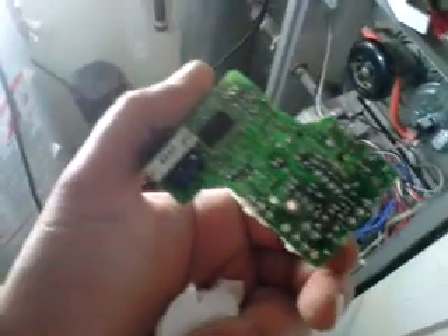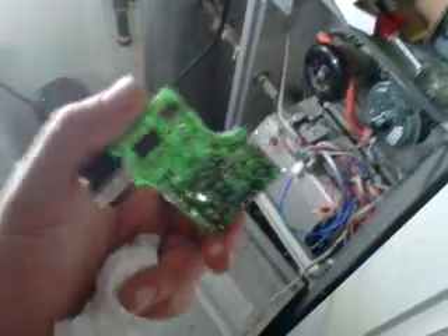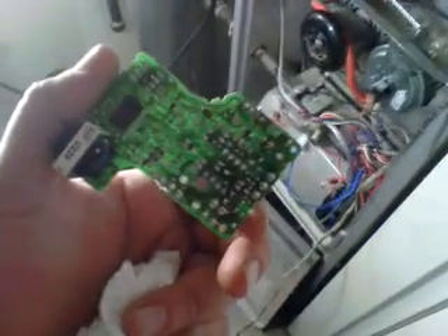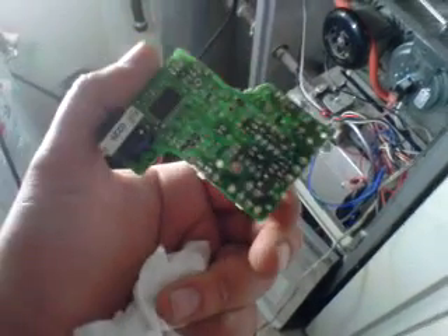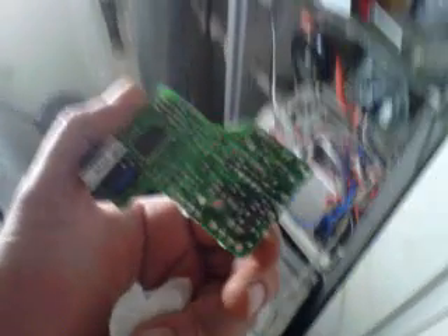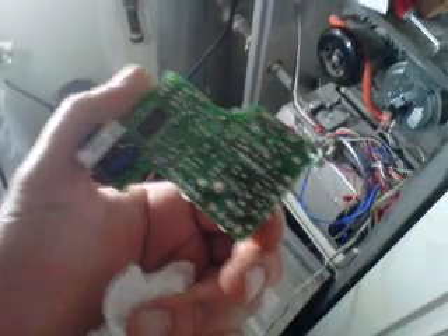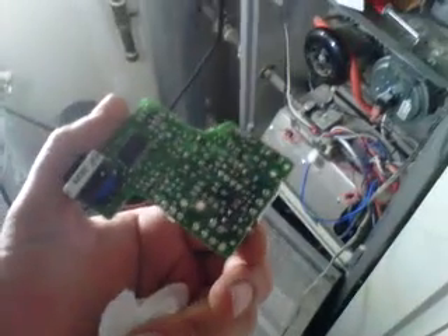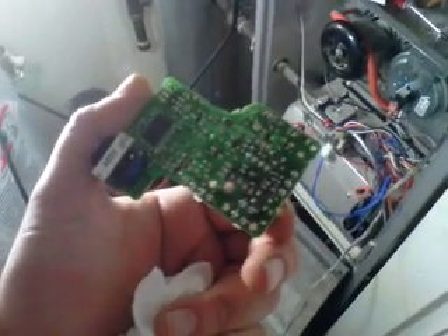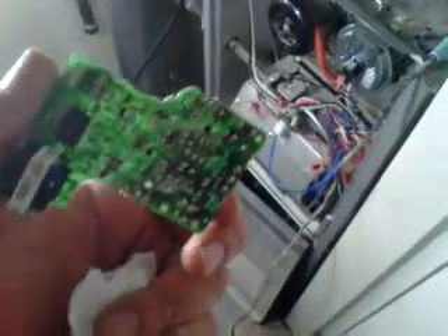What we're going to do is reflow those real quick — this isn't going to take long. I'll throw this board back on and test the furnace and see what happens. I've got a pretty good confidence level that this is going to fix my problem with this furnace. If at the end of the day it doesn't, I'm going to be forced to replace the smart valve.